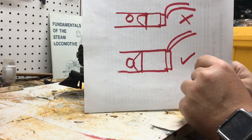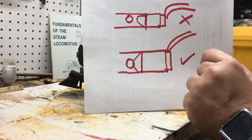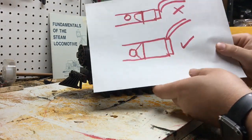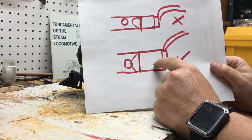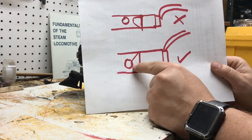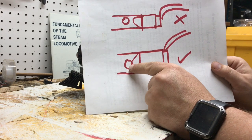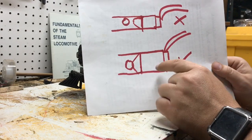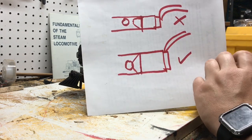So I started thinking, instead of burner and nozzle, think of it like a carburetor. Now this has an adjustment. You can screw it in, and through trial and error, I would unscrew the jet so it got closer to that intake hole for the air, which richened up the mixture that was fired down the burner. Like I said, through trial and error, I'm not sure it's the exact way to do it, but it's the way I did it, and it's the way that I found worked.